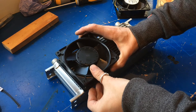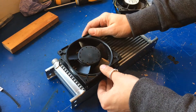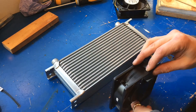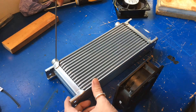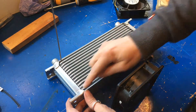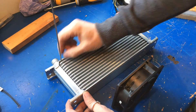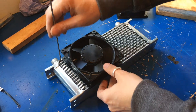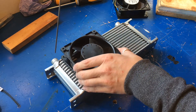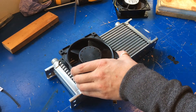The first thing I need to do is mount these fans tight up against the cooler face to force air through it. The simplest way is to use the small spaces between the cooler channels and get some M3 studding through there to mount the fans directly on. Unfortunately I don't have any M3 studding, so for this temporary test I'm going to cable tie the fans on through those same fixing holes.